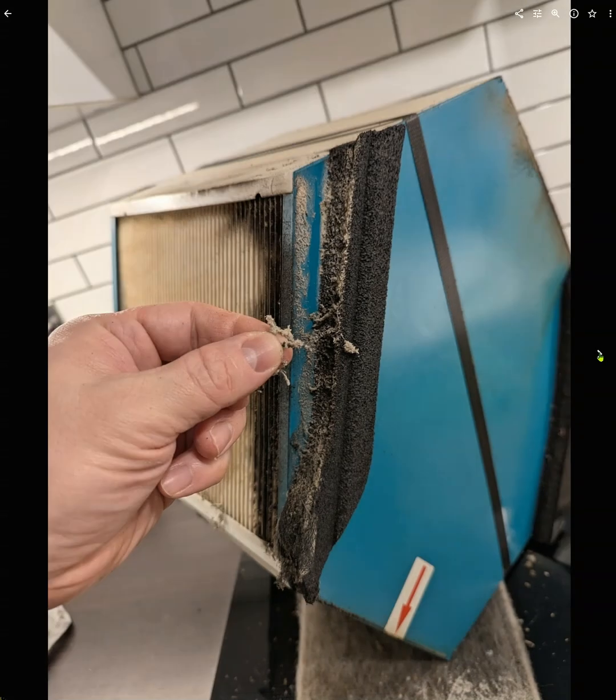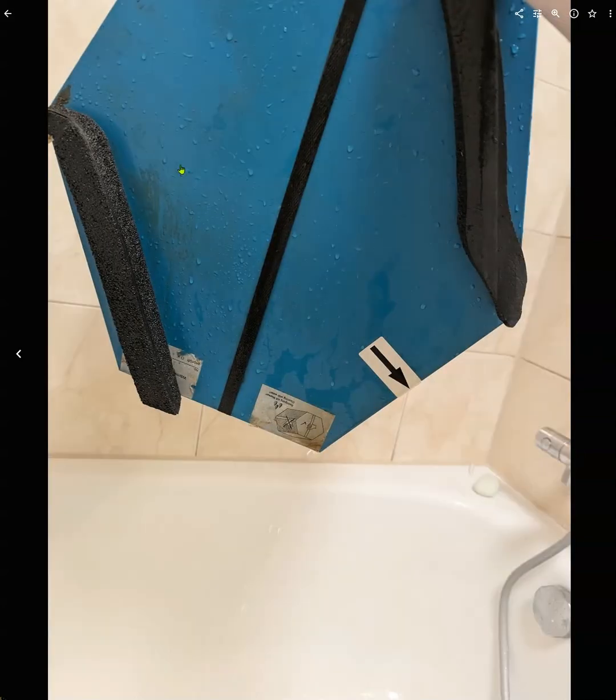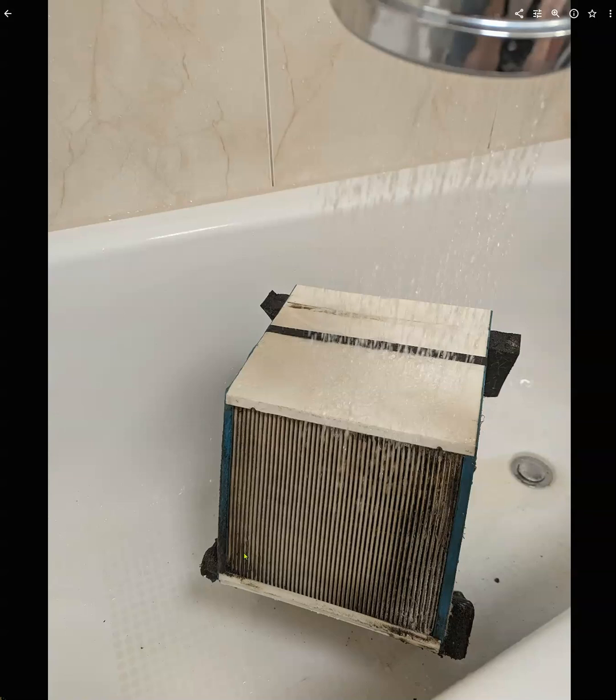You can see a bit more of the dirt here. This unit needs to be really, really rinsed in the bath — you'll see lots of bits come out. I didn't use soap. Just be careful because this whole unit is like £3,000, so be really careful with this thing. I'm just letting it drip and shaking it, moving it around to really get the water out. The oil from cooking fish and meat and so on just gets stuck with dust — it all blocks it up.